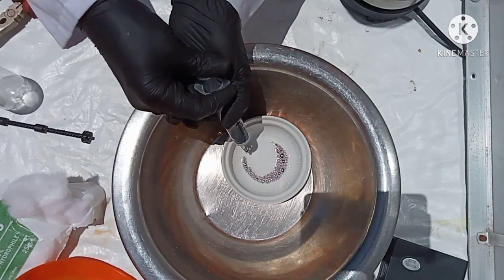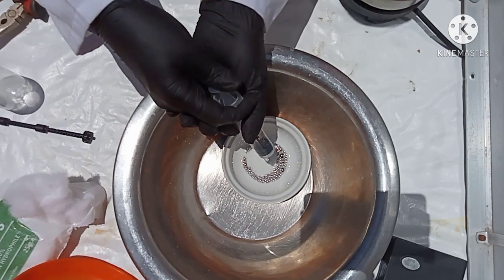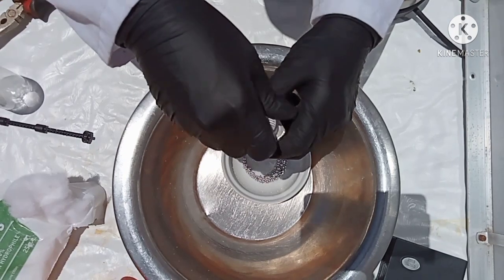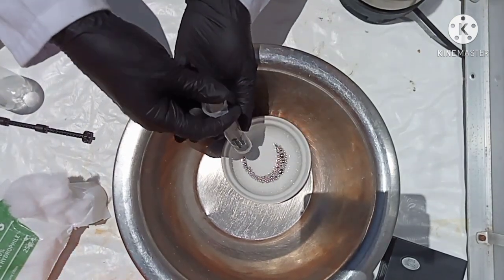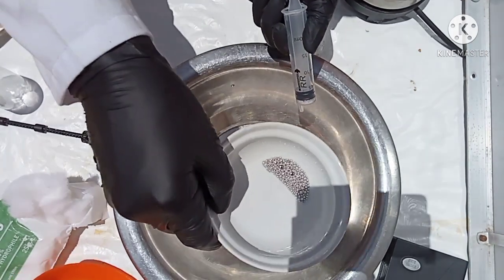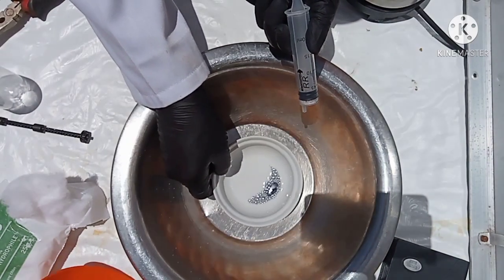The preferred small-lot method is to place a wet cotton wad in the bottom of a hypodermic syringe, place the amalgam in the barrel, replace the plunger, and squeeze the amalgam against the wet cotton. The mercury goes through, leaving behind a slug of gold and some mercury. This method produces an extremely fine separation compared to the chamois, and at the same time is much easier.